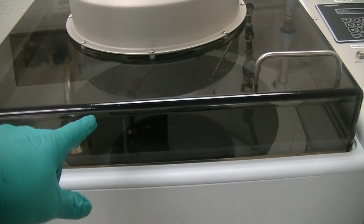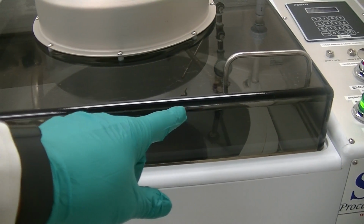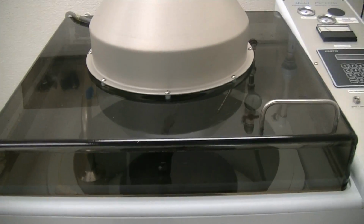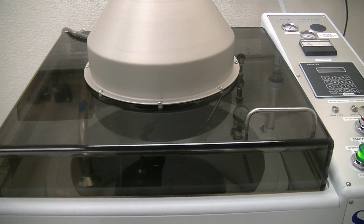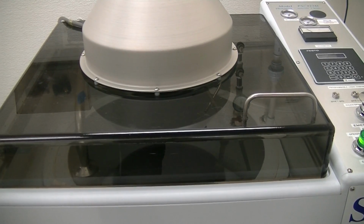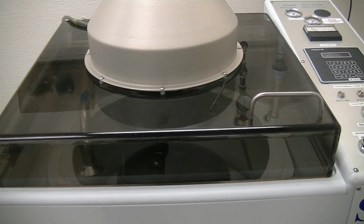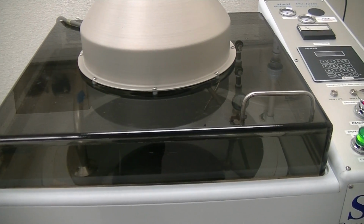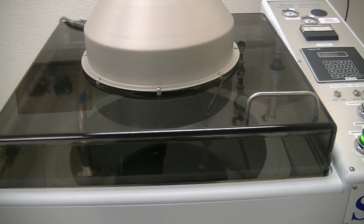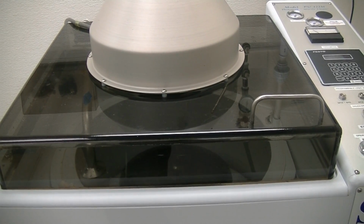All right. As you can see now, the high pressure is stroking back and forth. There's a valve in the back that's programmable. You have to go past center line to be able to clean the whole mask. We actually had set it up to go past center line to about 80% across the substrate. You get good coverage, and then as it goes back to the home position, it goes off the chuck and comes through. This allows you to get complete coverage of the high pressure scrub.